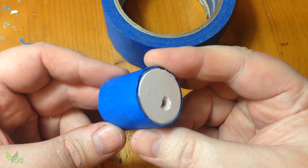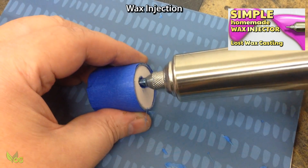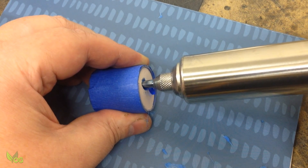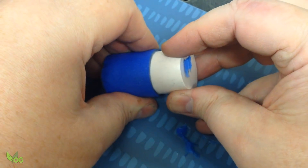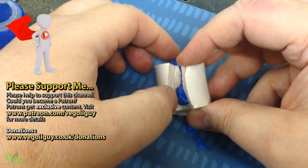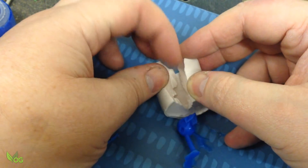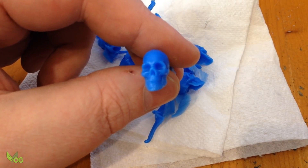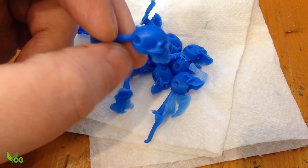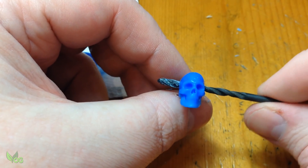I put back the plastic bottle and wrap some tape around it for support. Last week I demonstrated my lost wax casting injection setup — it's simple, but it really works. I allow 5 to 10 minutes after injection for the wax to cool. The silicone is then pushed free of the plastic support and gently prised apart to remove the wax pattern. Some have flashing, but this wax is easily trimmed away — better to do it now than when it's metal. A hole is easily drilled by hand through the soft wax.